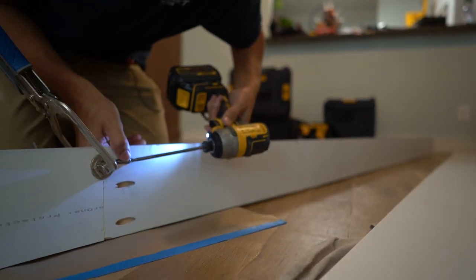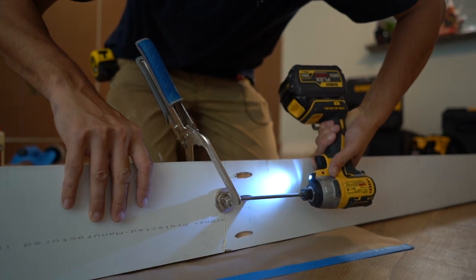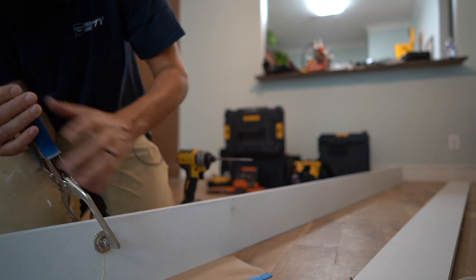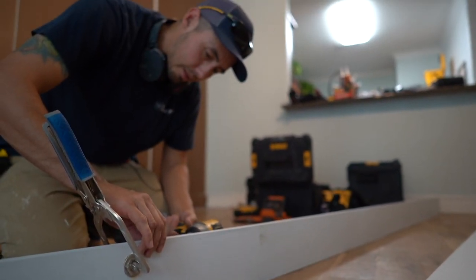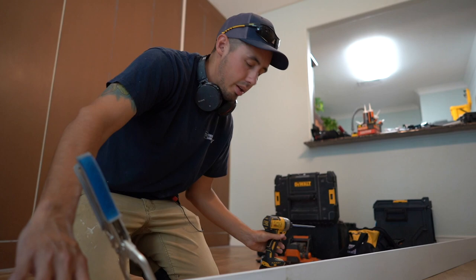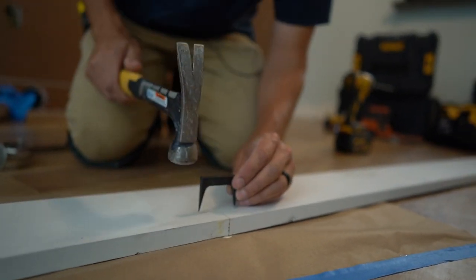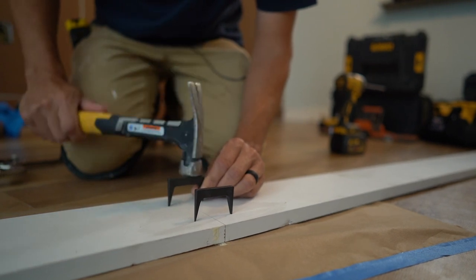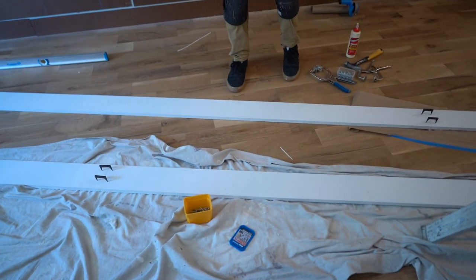Okay, that one's good. I can't reach that one if I support it on this short end over here. Okay, this is good now — we're golden. I'll get this last pocket screw in, clean up that squeeze out, and put some pinch dogs in there. I could probably crank those screws down a little bit more, but to avoid stripping them out I'll just throw some of these on. These little pinch dogs will just pull that seam tighter while the glue's setting.